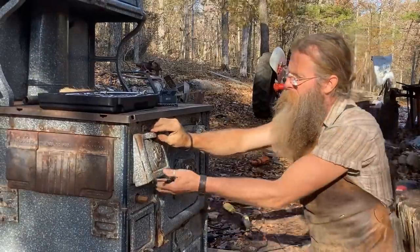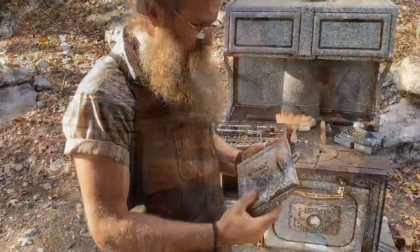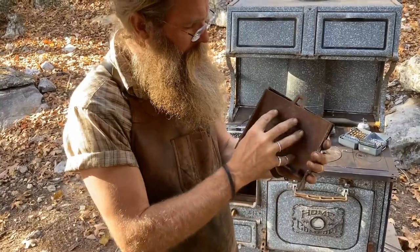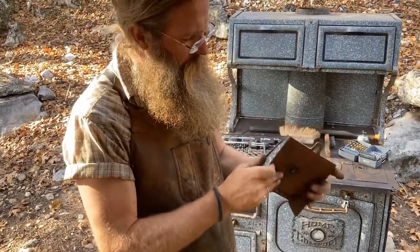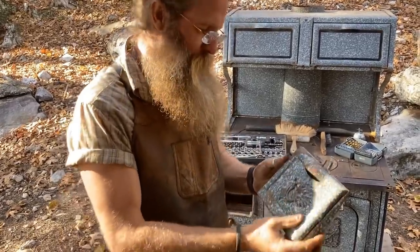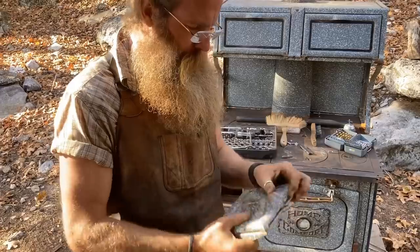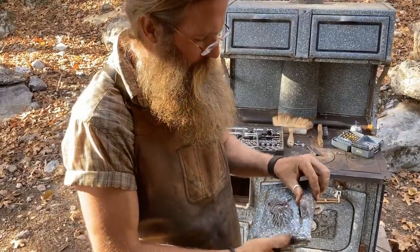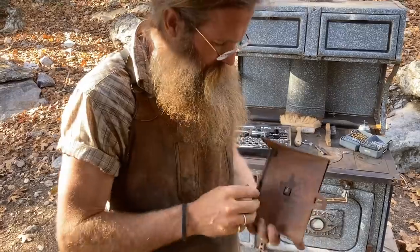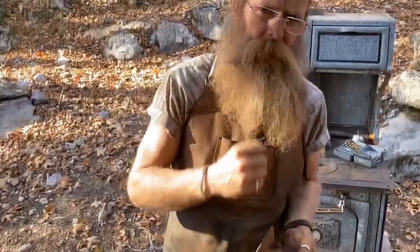We're going to tune up this firebox door right here — it's a little loose. There is an airspace in there that's supposed to be there, so the fire will hit the inside and then that airspace allows it to cool, so when you open it you don't burn your hands. The problem is that screw is loose and also rusted and seized up. The front plate slides up and it disables the latch, so we've got to get that screw out of there. I think we're going to center punch it and then drill it.